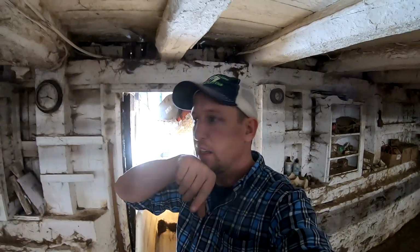How's it going, everybody? This video is about getting everything ready for harvest. We're going to be working on the combine and getting the grain cart set up and greased up. On the combine, there was a bearing we had to replace on a shaft on the cleaning screen on the side right by the radiator. I'll show you that. And we're changing the oil in it. So just kind of showing all that.